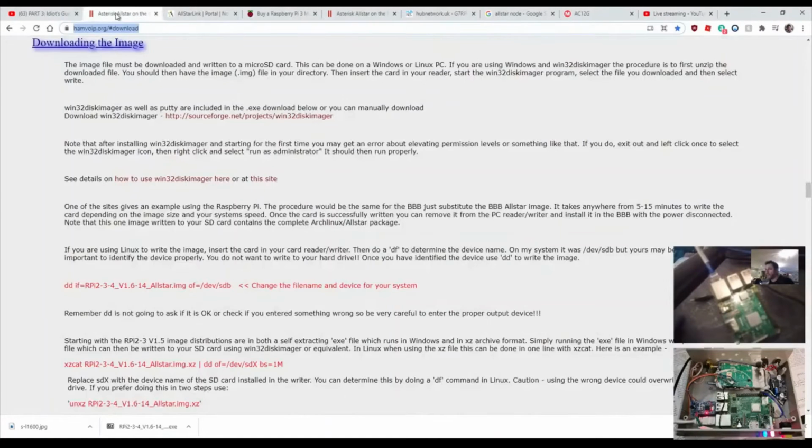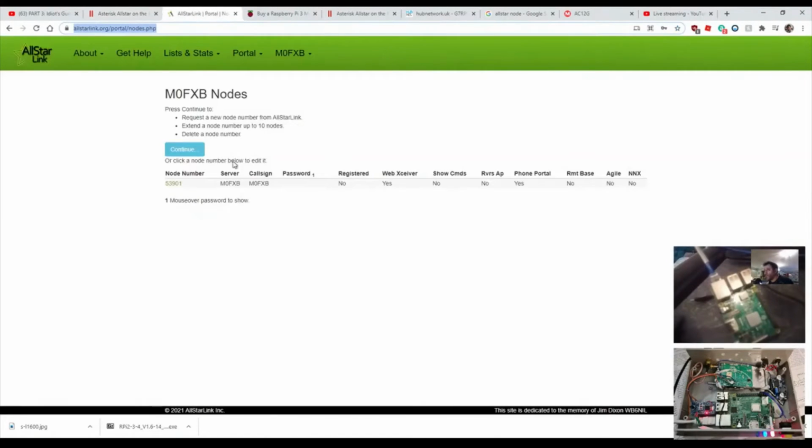M0FXB. Just playing around here with ALLSTAR. I've already got a node. So if you haven't got a node number, go to the ALLSTAR website. I'll put the links in the description, and create yourself an account, and then go to your call sign once you've got the account. Go to Portal, go to Node Settings, and here you can ask for a node number. They only allow you to have 2, so I've got 1. And to see your password, you scroll over, and it lights up.